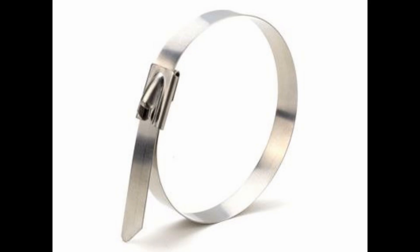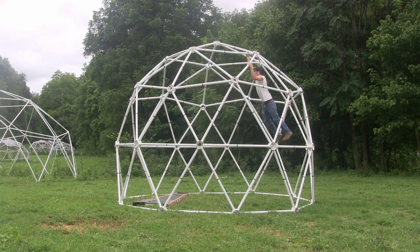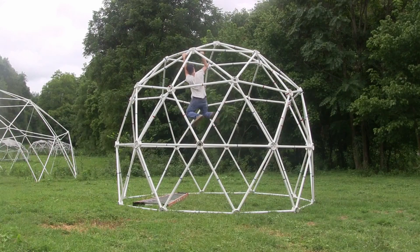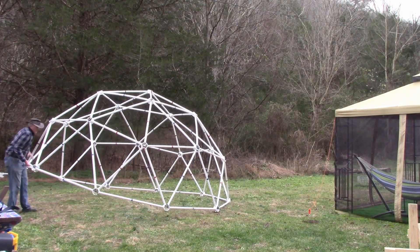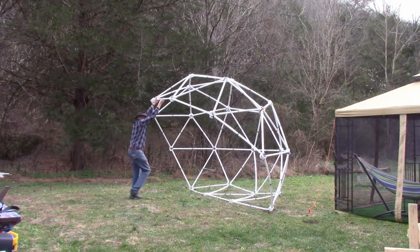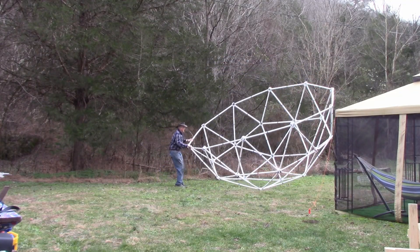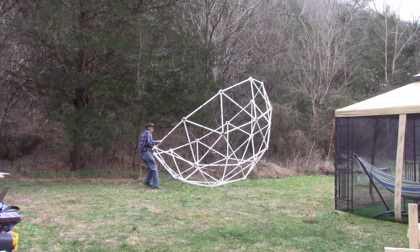And when we use 250-pound stainless steel zip ties, the zip tie connectors will hold well over 300 pounds, as in this example of a silo dome. Looking at our test dome with the locking collars, when I take this same 13-foot dome with 120-pound zip ties and roll it over, you can see how the dome does not collapse upon itself as it did without the locking collars. The locking collars make this dome much stronger than without them.